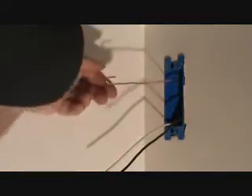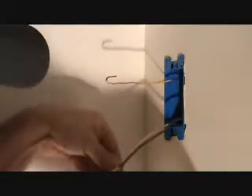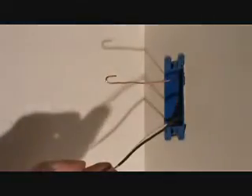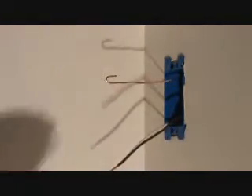I'm going to take that and roll it up and slide that off. Now I'm going to bend that a little bit more and that's how I want that loop for right now. So now I can strip this back and I'm using the number 12 hole still. I want to strip that back further than when connecting it with a wire nut because I've got to take this and do the same thing — bend those up, and I've got to have enough room without the rubber sheathing in my way.